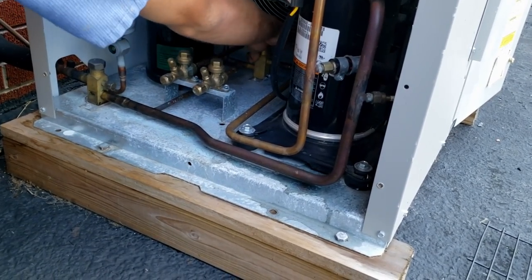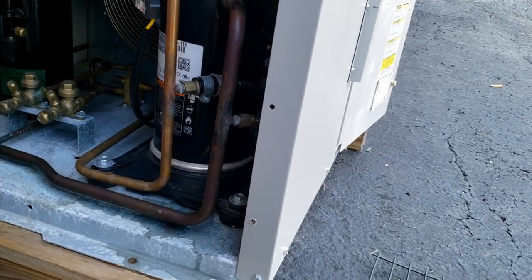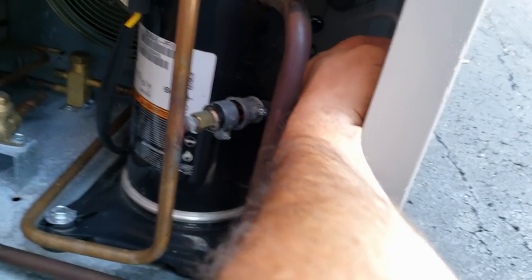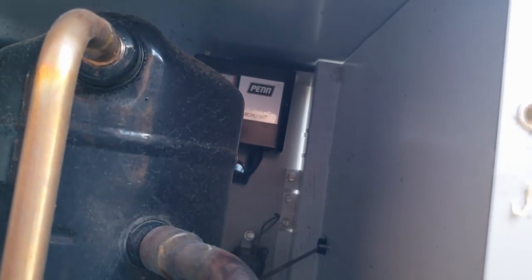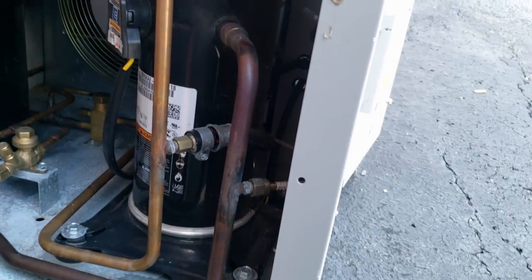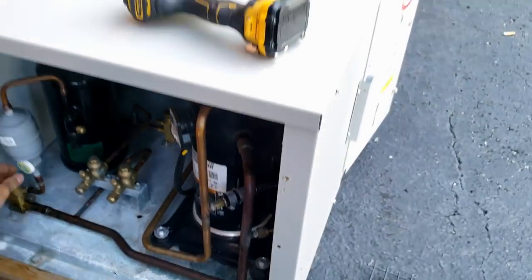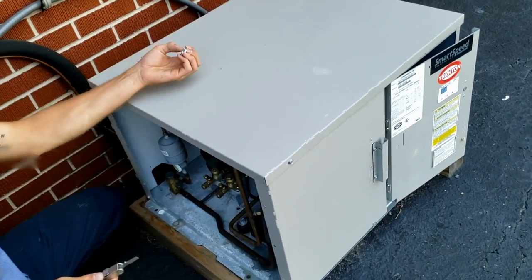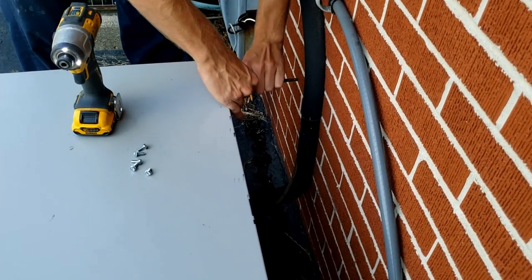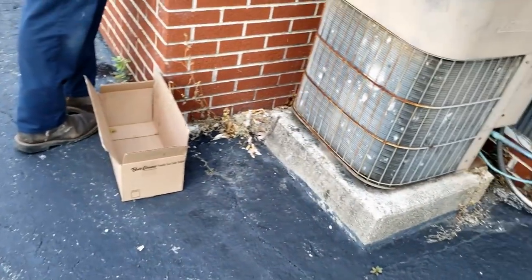These are kind of nice valves — you can actually pull it down and pull a vacuum, a little bit nicer than the bone unit. The low pressure switch is on that tube right there. If it's set too high or too low it can cause it to go into a negative, and if you ever get a leak you want to make sure the thing shuts off before it gets into negative — it would suck air in and destroy the compressor. We'll check that and then pop the top, put gauges on the suction side and check our superheat. I use a regular one with an extension — that way I can always separate it, plus it's cheaper.